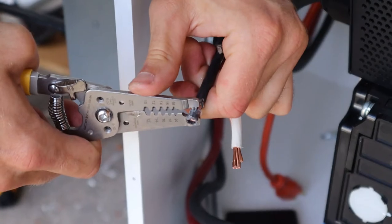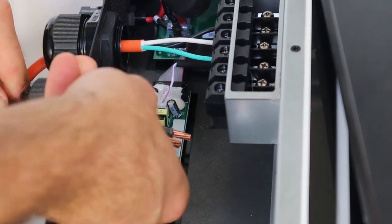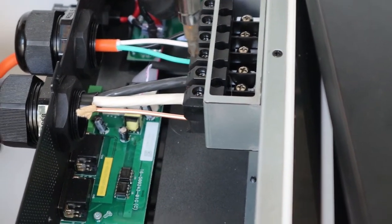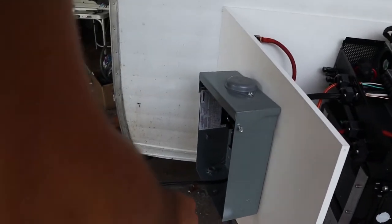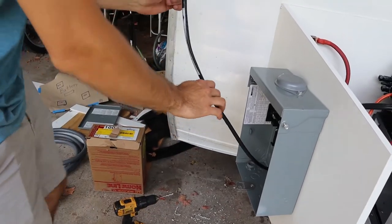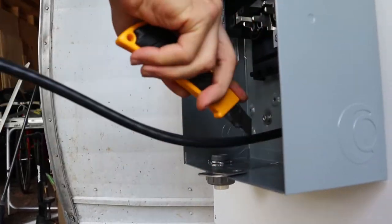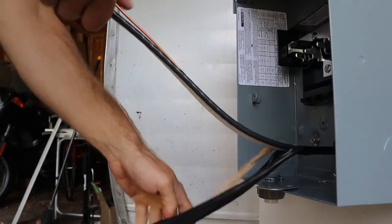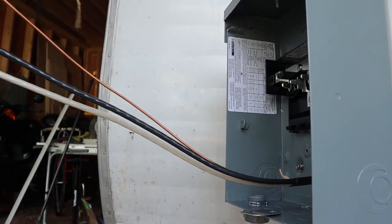This wire will connect the battery system to the circuit breaker panel. There was a lot more adjusting than we showed here, but sometimes it's fun to pretend that everything happened smoothly the first time. Now we're going to have to decide how much we're going to want. You can see that when Cormac takes off the outer material, three separate wires are exposed. There's an exposed ground wire, the white neutral wire, and the black hot wire, which carries 120 volts.